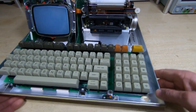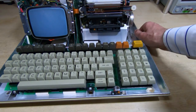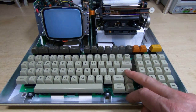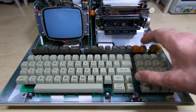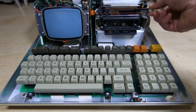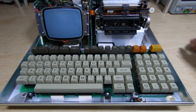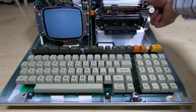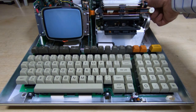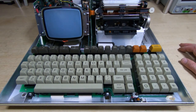In the next video I'll start by addressing the keyboard issue — they're fairly easy to repair, nothing particularly complex. Then we'll look at the main processor board and try to figure out any faults there. After that we'll get on to the cassette mechanism. It's a bit dirty and fairly sticky. I can see the head definitely needs cleaning and the roller is pretty much gone, so that will need to be sorted out. Should make quite an interesting project.